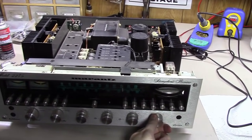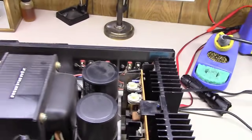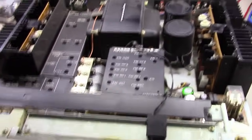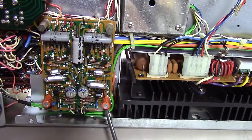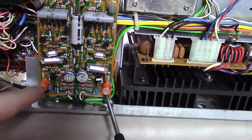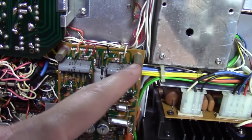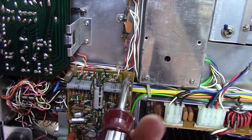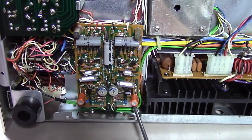Testing again — I can already tell the bass is tighter on this thing, less sloppy. Got this output board recapped, got the other output board recapped, got the power supply recapped. Now I'm going to hit the preamp board, then bias the thing, then get to the cosmetic side. The preamp board is underneath here — it's got a couple capacitors I'd like to replace. It's got two screws on the bottom and then on one end there are studs requiring a quarter-inch nut driver. You might have to cut a few wire straps loose, but you can get this thing off far enough to unsolder and replace the capacitors.